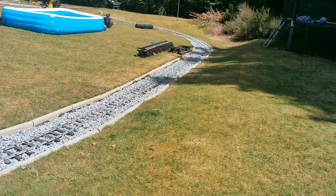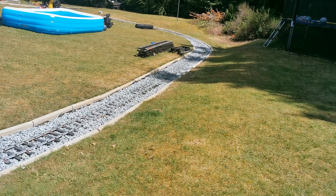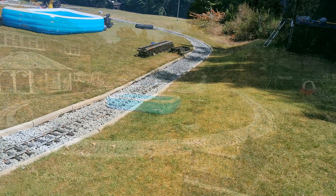There are a couple of ways of finding low spots, and the easiest by far is to just put a loco on it, run it round at low speed. When it slows down, it's obviously going uphill or encountering greater friction like points or steep corners, and when it accelerates, it's obviously going downhill. So I'm running into a trough. I'll do a quick mental map of that and start sprinkling the ballast and adjusting the track accordingly thereafter.